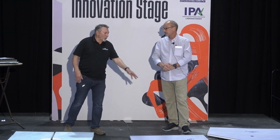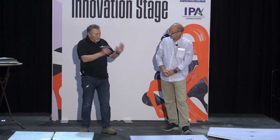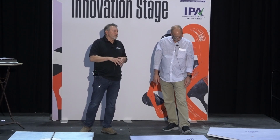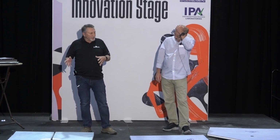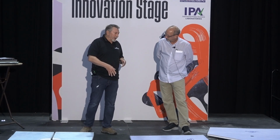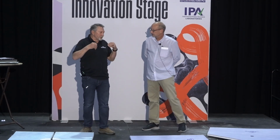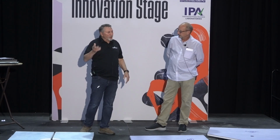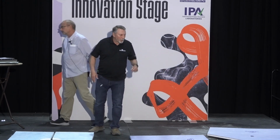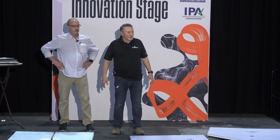Using the pre-waterproof bases, say you want to really rock and roll on this job and you want to set tile the next day, you can throw that base down with some speed set mortar, do all the tie-ins with the wall and the drain with our NobleSeal 250, which is a moisture cure sealant. You can immediately water test for that. So you get it in, water test it, it passes, the next day you're tiling. If you're using modified thin set and some of the other systems to do your seam sealing, you have to wait overnight before you can do a water test. So the labor saving is huge on this. And again, with the dust control laws that are out there now, all you have to do is mix up a little thin set for this.